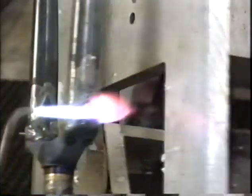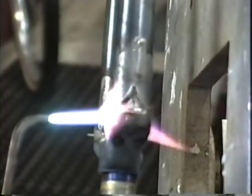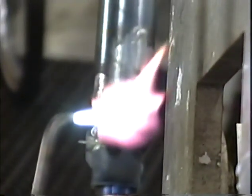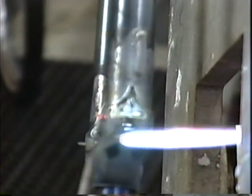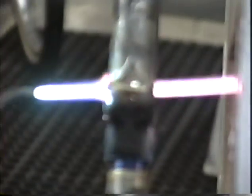Work on the other way. Now we're getting a little bit of buildup inside our window here, so we need to heat up and pull that buildup away from the window. You don't have to worry about these pins anymore. Those pins are firmly silver brazed into the fork now. Pull this stuff down low, heat up way down here.